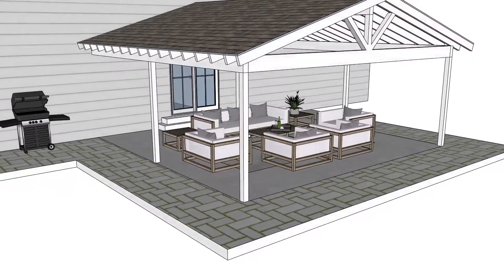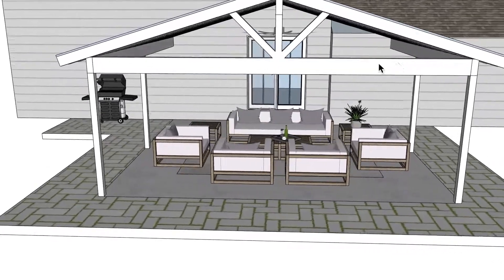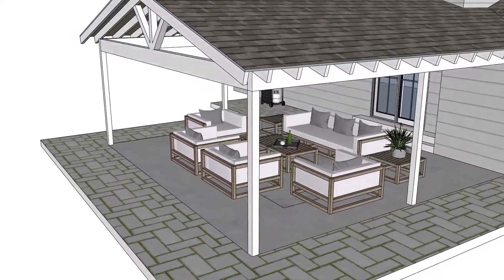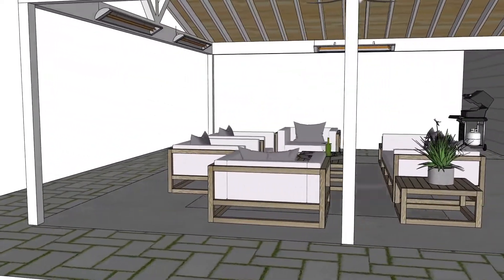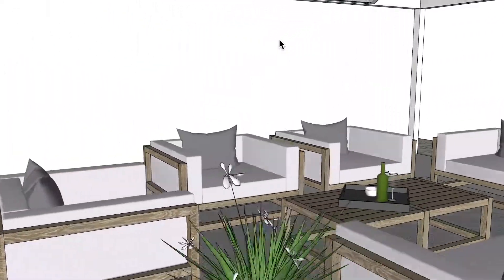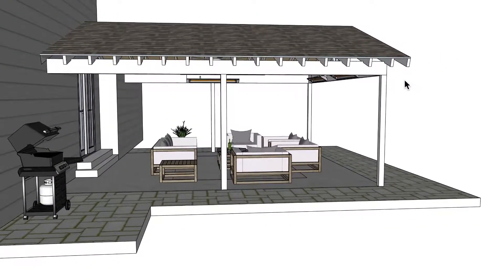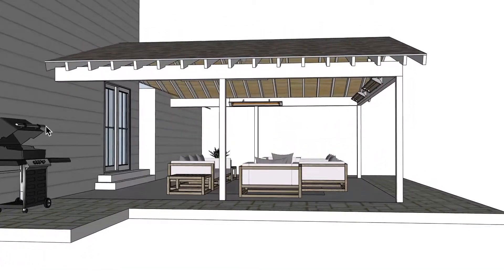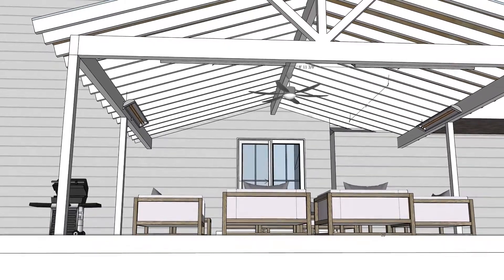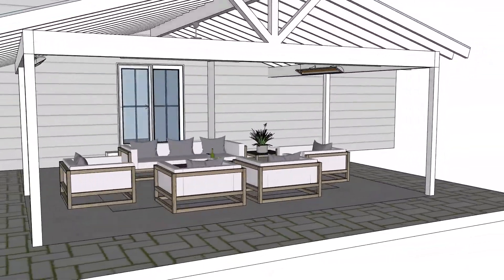I have two different options. Many times people ask me about placing heaters on the inside of these beams to keep a low profile as far as the appearance of the product. So let me show that first — this would be my second option. These are 6,000-watt units. I have four of them: one here, two up here, and one behind us. These two are centered within this 20-foot span — 10 feet from this wall — and these two I have approximately nine feet apart, center to center.